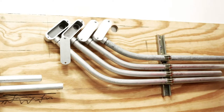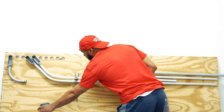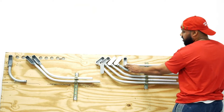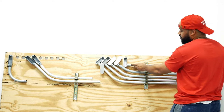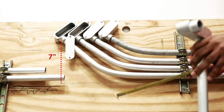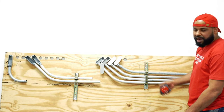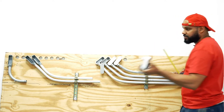These byproducts of the LB are basically designed for a short tight offset or short tight back-to-back 90. Going back to the demo video, what I was demonstrating was how you'll be able to utilize more pipes coming out of your wall with this perpendicular LB. We have seven inches of vertical space, and within that seven inches we'll be turning horizontally — we could fit five pipe runs.